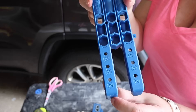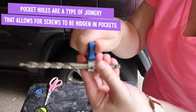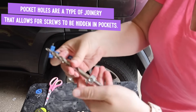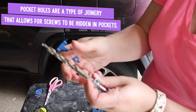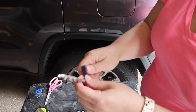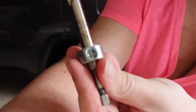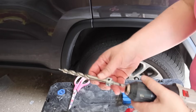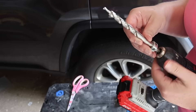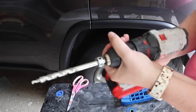We're going to do one and a half inch pocket holes that we need to drill. This is my normal Kreg jig — all I need to do is take this little tool that comes with the set and adjust my drill bit to one and a half inches so it can go deep enough into the wood. This little tool comes with the small kit so you don't have to worry about needing something else, and you can get this for about $40. As far as installing the bits into your drill, it's just like a normal drill bit, which makes it really nice and easy.